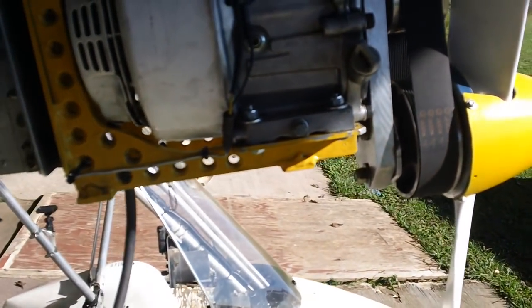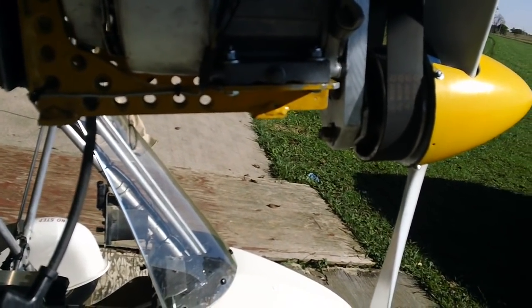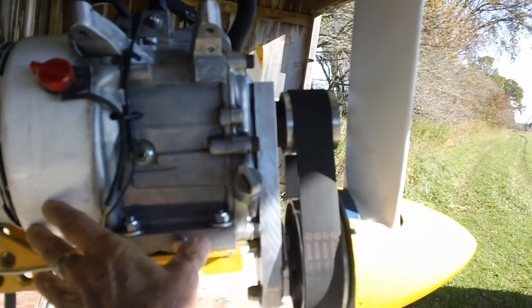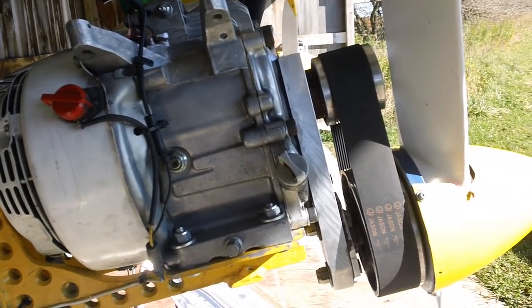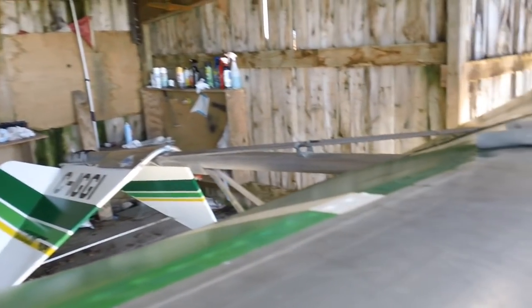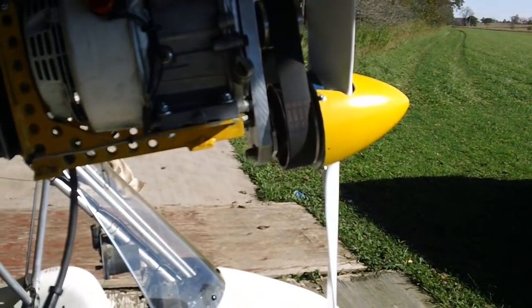The motors are fairly heavy of course, and with those heavy motor mounts and the simple fact that the motor sits a head further than the old Rotax, that of course increases the arm on the CG. It makes quite a difference — I ended up putting five pounds of weight on the tail, and it flies hands-off now. It flies nicely.